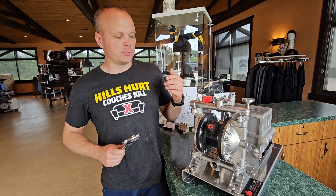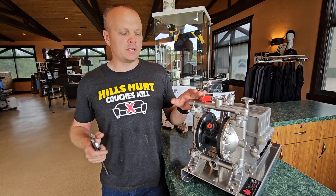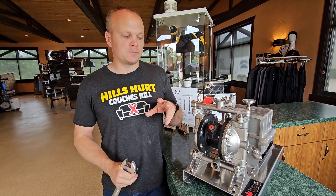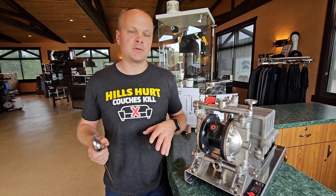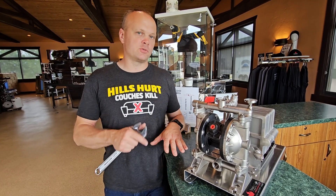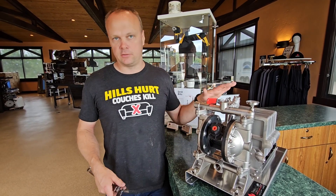I'm going to dig into it and just show you. This troubleshooting step would be the first thing I look at if you give the pump air and it really does nothing at all. If you can hear the pump ca-thunking — ca-thunk, ca-thunk, ca-thunk — that's the normal rhythm the pump should have when it's working. If it's ca-thunking but not pumping, that's a different video. This issue identifies itself by virtually nothing happening when you put the air on — maybe a little hissing, but nothing else.